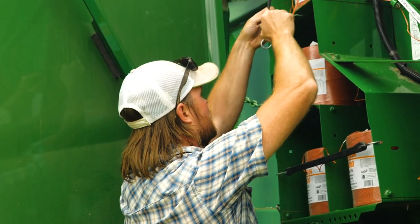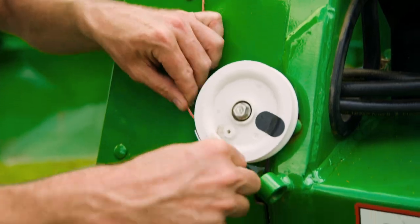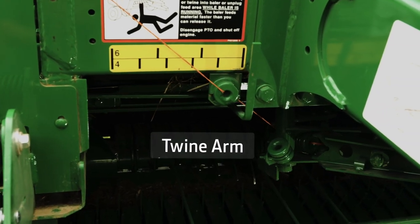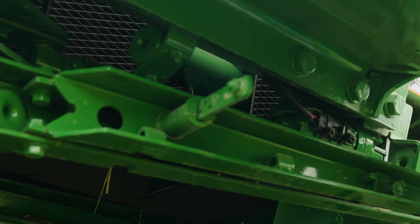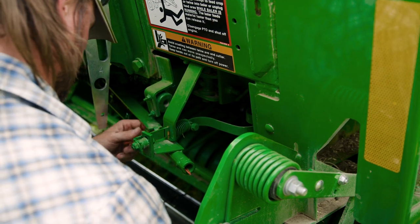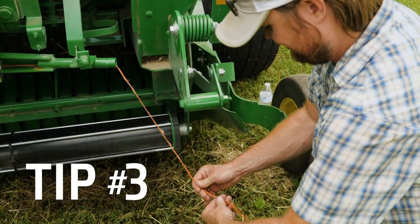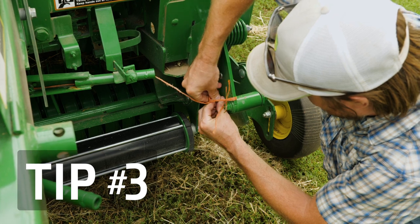Then reattach the retainer straps. For plastic or small sisal twine, route the twine through the twine guide and then wrap it a full turn around the twine moving indicator wheel. It must route behind the strand that comes down from the twine box. Ultimately, the twine ends up at the twine arm. At that point, hold the two twine arms together and remove the spring pin. Remove any crop residue, then thread the twine along the twine arm, through the twine tensioning system, and out through the twine tube on the end of the arm. Pull the twine 12 to 15 inches beyond the end of the tube and cut it off. Here's tip number three: tie off the end of the twine to the baler to hold it in place during transport to the field, just in case that twine has the urge to unthread itself a little during the trip.